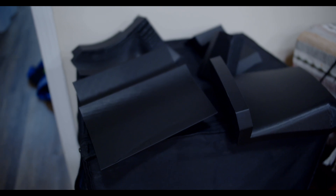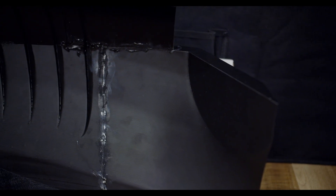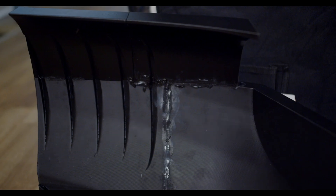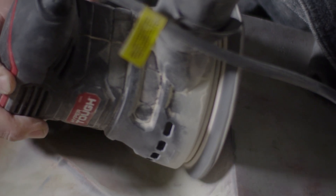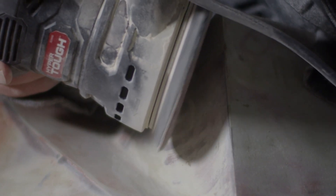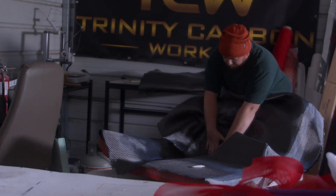This mold is really big — it's the size of a front clip of a car, or at least half of it. There's got to be a numbering system in place, and there's some software I use for that. Please message me if you'd like to know the name. Once you get all the pieces, I assembled it with Gorilla Glue gel and that seemed to hold really well. I then filled all the seams and the layer lines with Bondo and sanded it. There's the mold with the in-mold clear and it looked pretty good — a quick clip of the layup of the part.